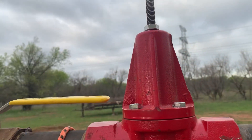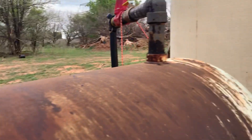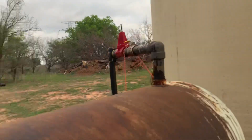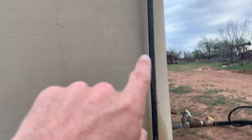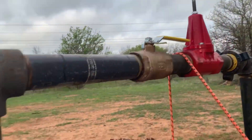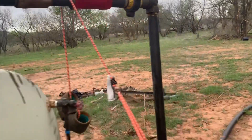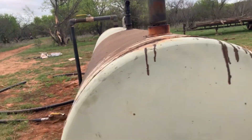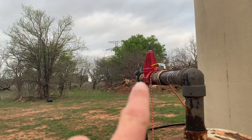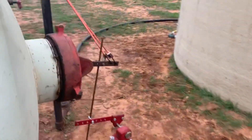This is the pressure regulator — you turn it right or left on pressure, just barely like a quarter turn, and then here's your pressure gauge. We need about 15 feet up here, and you figure half a pound per foot going up — so about 15 feet means your pressure for the oil to go needs to be about eight pounds. You've got around seven pounds to overcome and you need at least eight pounds here to push it through. You turn the regulator to either open up the pressure or ease it off.